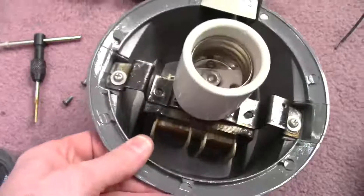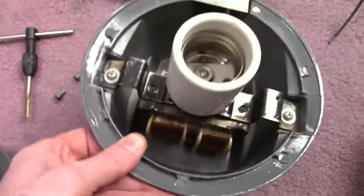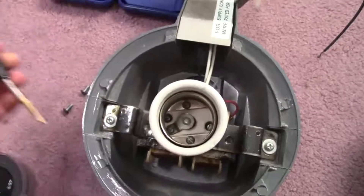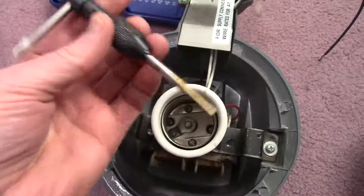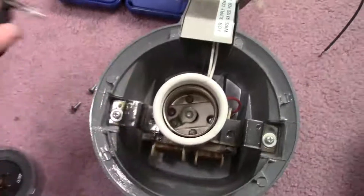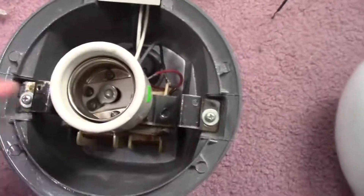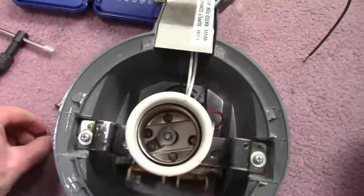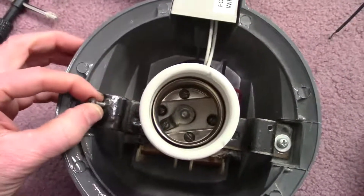The problem is it would not fit this fixture — the screws would not fit and I couldn't find a screw to fit it, so I just tapped it out with an 8-32 tap. Same thing with the holes for the light shade diffuser.